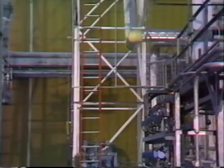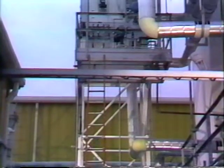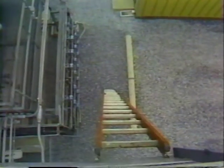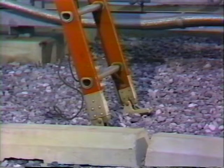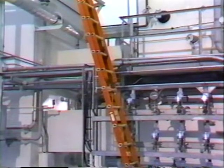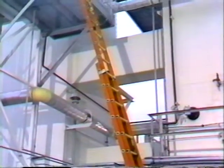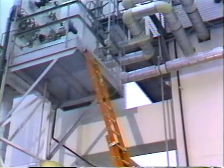If you need to escape from a platform 20 feet high and the ladder falls 6 inches short from reaching it, those 6 inches can seem like 60 when you need to quickly evacuate the site. Also, you need a steady support base for the ladder. This becomes increasingly important when the ladder is fully extended. Your weight can cause it to become top-heavy, and in an emergency, you need to make sure that you're on steady ground.